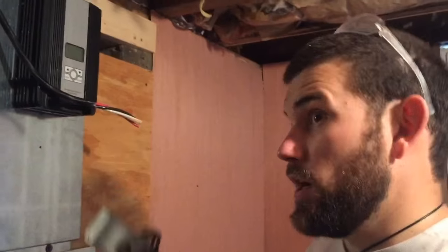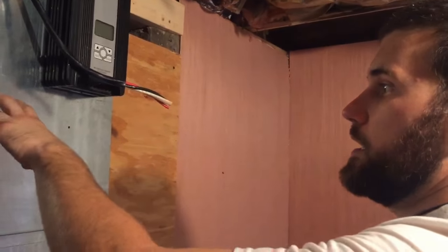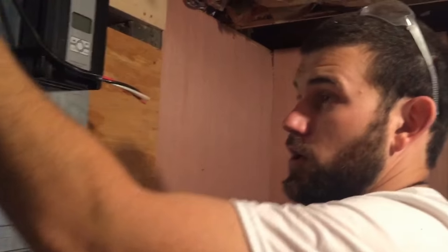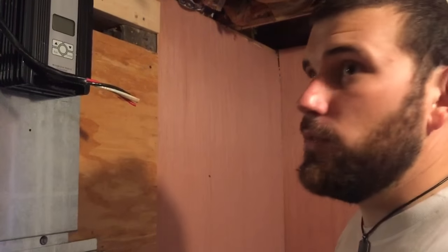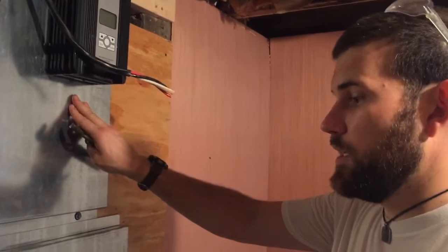The reason I'm putting these on the brake right now is obvious — I'm about to get up there and put blade sets on. If you're going to do your own wiring, you always want to make sure to get to this point with your wiring from the turbine without the blade set on the rotor. You want to come from there to at least your brake switch so you're safe to work up there. I don't care if there's not a stitch of wind — you might be cranking the last bit down on that turbine, the wind kicks up, and bad things happen. You end up in the hospital or dead.